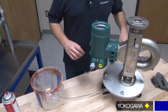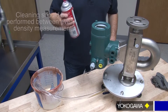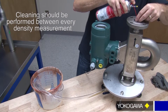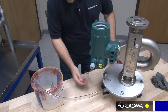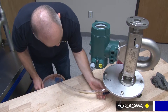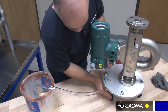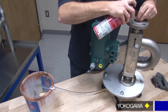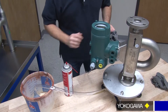Once we finish our oil sample, we have to clean the device out before we can take our water sample. We recommend using some type of solvent, either a carburetor or brake cleaner. You just want to spray a little in here at first into the tubes, spray it around the end, and let it run through there. Then close the valve and fill the tubes up — each tube — to the top and let that sit for a minute or two.